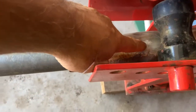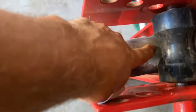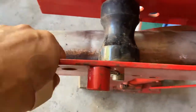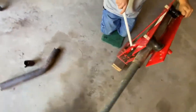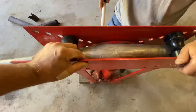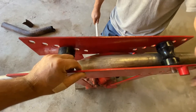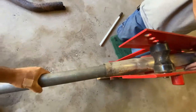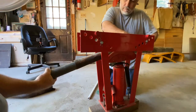So what happened is we were starting to crush the pipe here. Again, we're not heating it up. What I did is I got a pipe that fits in there. We straightened it out a little bit, and we're going to use this to at least maintain most of the shape so this doesn't crush into it, because it was bending nicely down in here. So we're going to go ahead and go to it again. It feels like it's starting to flatten out. I'm going to turn the light on and go a couple more pumps, see what happens. We're not looking for precision here.